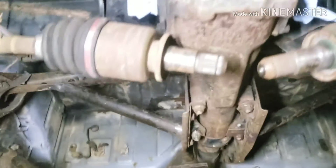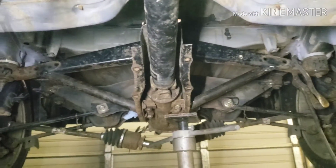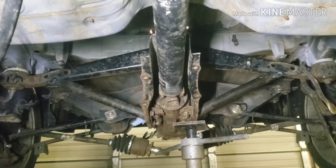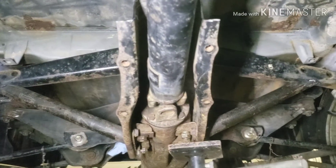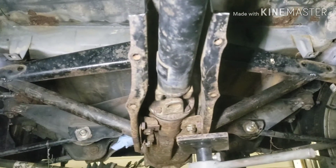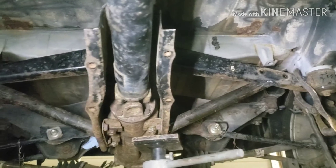Tack her in. I don't think I have enough pipe to make these other ones, so I'm going to have to wait until I go to the metal shop and get some more pipe, then we'll tack it all in. Probably pull this diff out and weld it fully, get it painted and all that. For now I'll probably do a couple more fat welds on these pipes — from here to there and to the bars up there — and I'll probably run it like that at least for the initial test drive. I don't really feel like pulling this diff back out right now, I really just want to make this thing run and just drive around, make sure I can shift it through the gears, make sure there's no weird issues because of things being modified, and go from there, then tear it apart and make it all look good and pretty.